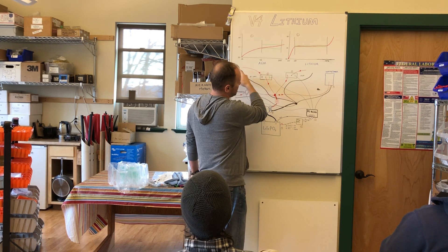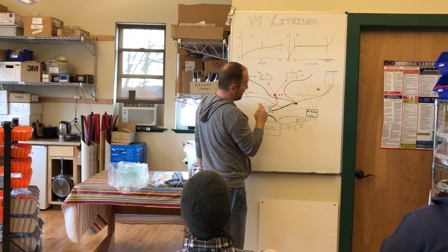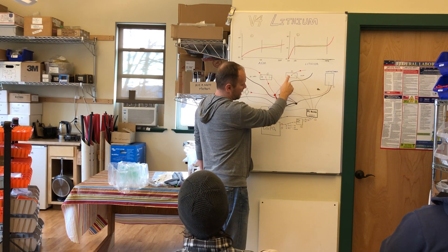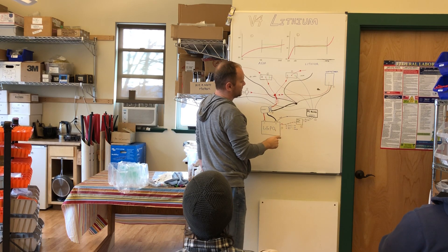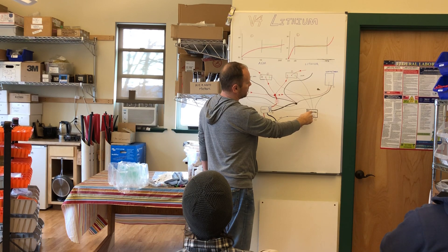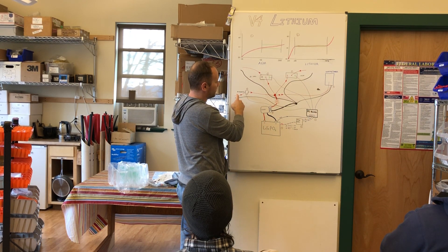For solar, the BP100 orientation is reversed — current goes into the battery rather than out — because solar is a charging source. This disconnects when there's a CD (charge disconnect) signal, and it also disconnects when the batteries are freezing. All of that is calculated by the V4 board.